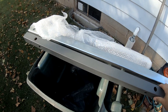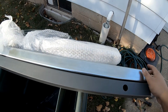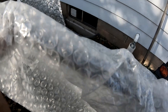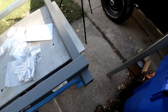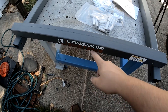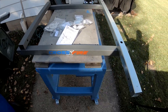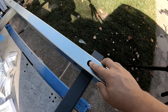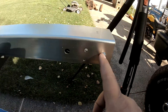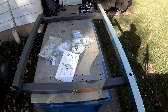If you buy the non-XL package you're going to get two shorter pieces — one will be powder coated, one looks like it's galvanized or nickel-dipped — but those are not the ones you want to put on if you got the XL part. You'll also have a spare bearing in there, so just hold on to those. What you want to do is take the two pieces that came with your XL kit and put them on so the Langmuir logo faces out on top, the two Crossfire logos stick out, and the last one sits on top with the large holes facing in on both sides. The bottom holes point down and that's how you get it bolted together.